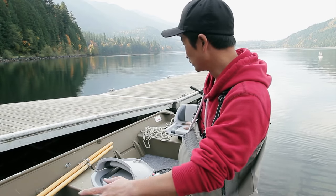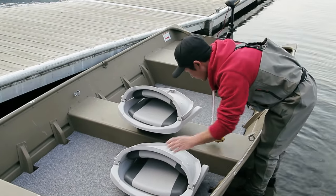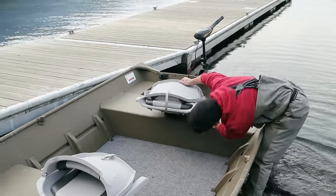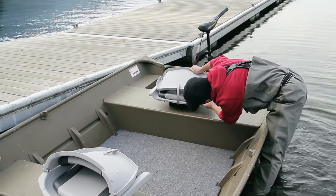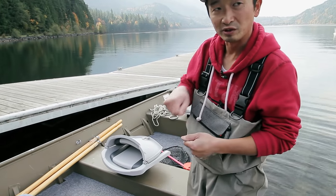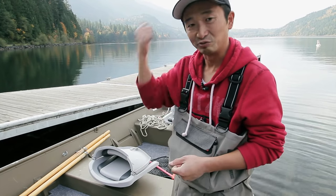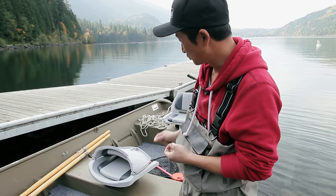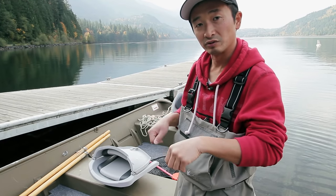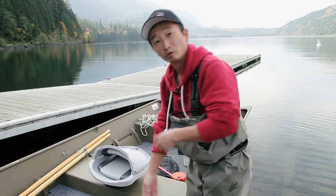This boat, at 14 foot long, can put three people in it. Right now we have two seats set up, but you can put another one there. These benches are thin aluminum, so when I set this up, you have to put a quick-release mount on the bottom — but you can't just put a screw into it because the aluminum is very thin and it's going to rip straight out. So what I had to do is put little anchors into the four corners and then put the screws in, which secures the mount for the seat pretty nicely.